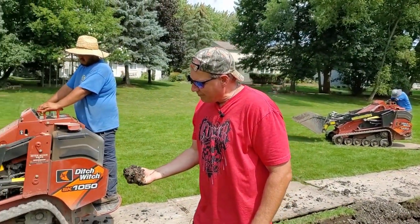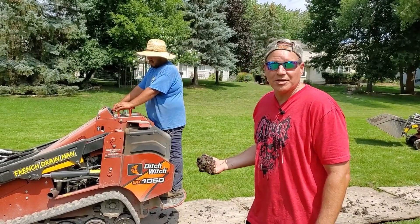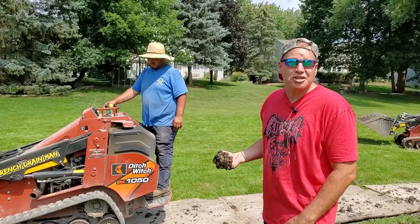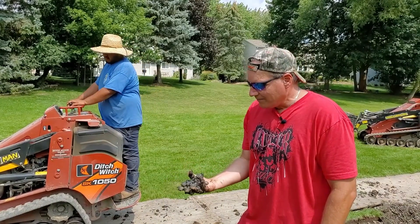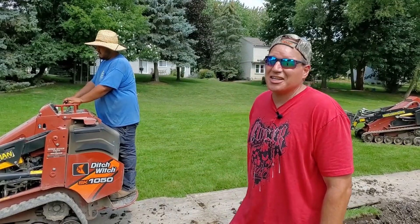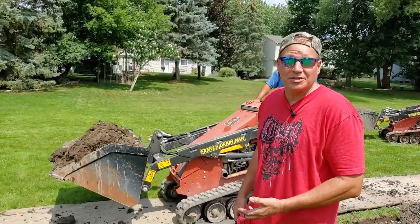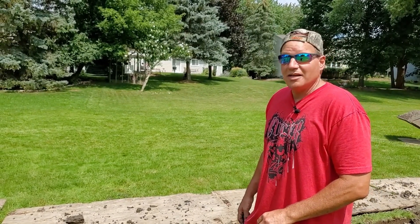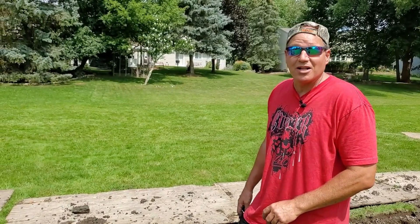All the voids in the stone are filled with sediment because they didn't believe in fabric. These were guys that wanted to save money — good fabric is expensive, and they wanted to save on labor too. It's so much cheaper for the contractor; it's a big cash grab. If he puts in a French drain system without drain fabric, the sediment fills the voids and he's got to come every year and jet it just to get the pipe to pass water. He keeps jetting it, so now you're on a maintenance schedule. This is exactly what guys want — they build up their clientele and eventually live off jetting out those systems every summer.